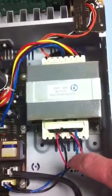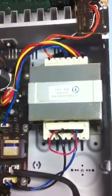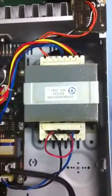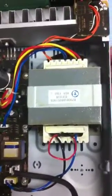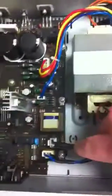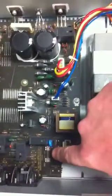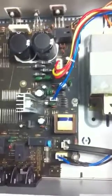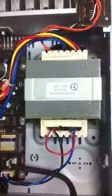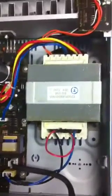So I was able to re-establish power to the primary. You don't really need it — it's just so the thing can't catch on fire, I guess. I have transformers in equipment that's older than I am and they've never caught on fire, and the circuit board has a fuse to protect the primary winding of the transformer. So it's just a thermal fuse, but I think it's an underrated thermal fuse — not temperature-wise, but current-wise.